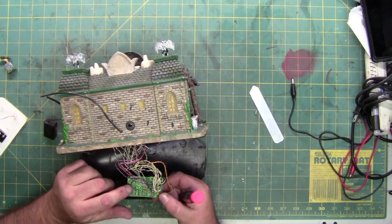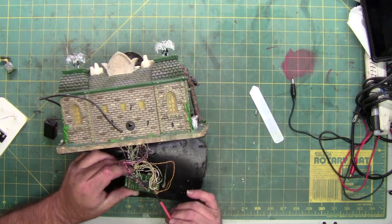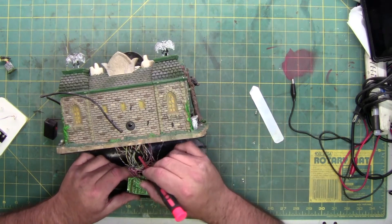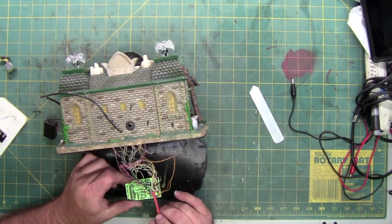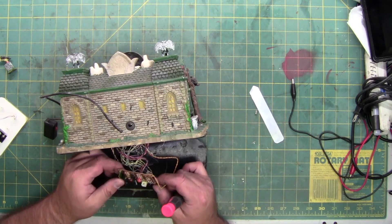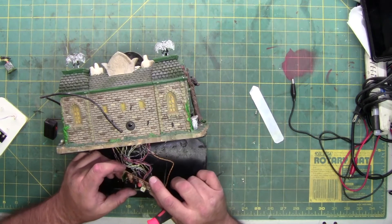All the yellow wires and all the orange wires are soldered in the lower right-hand spot, holding the COB chip board to your lower left. One orange wire is here, the other orange wire is right above it. The next two solder points up are all white wires. One of the white wires from the power switch is soldered to these purple wires. It's a pretty confusing little set — it's hard to tell you where they all go because you have to keep flipping it over and the space numbers are all covered by the resistors, so I'll do a close-up of it.